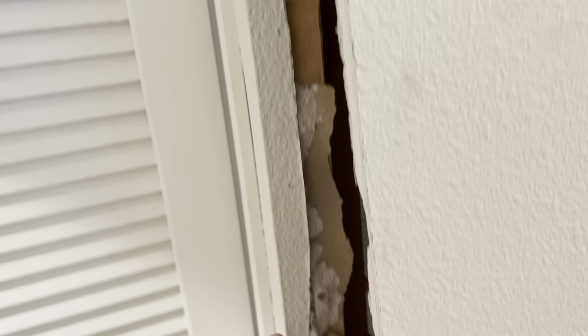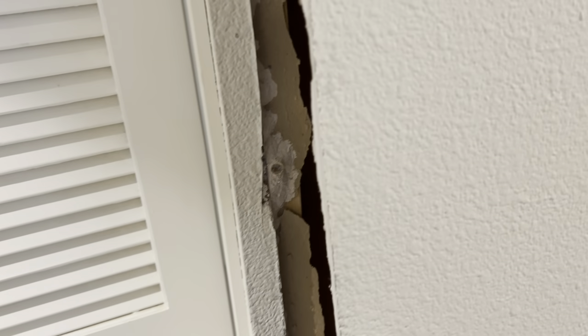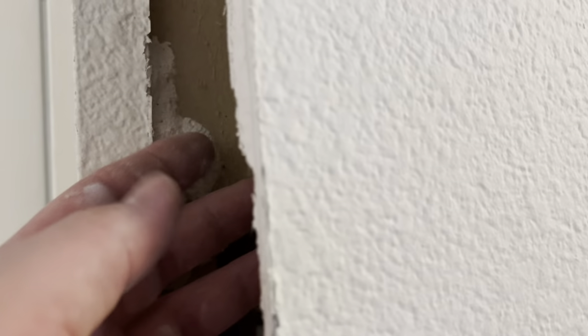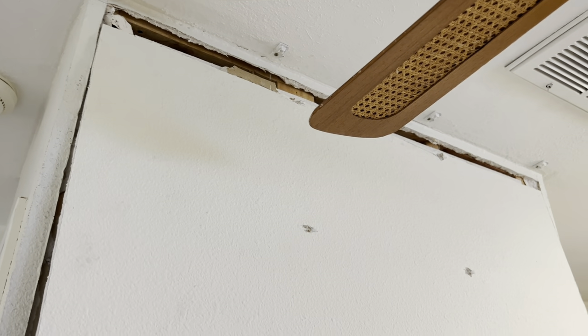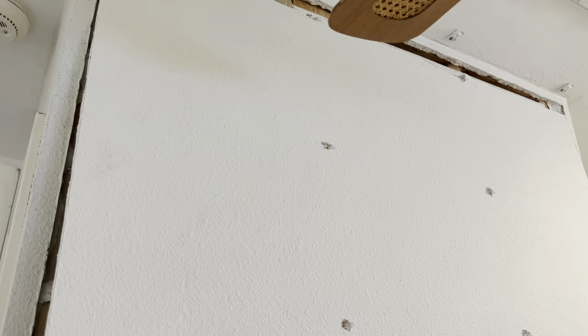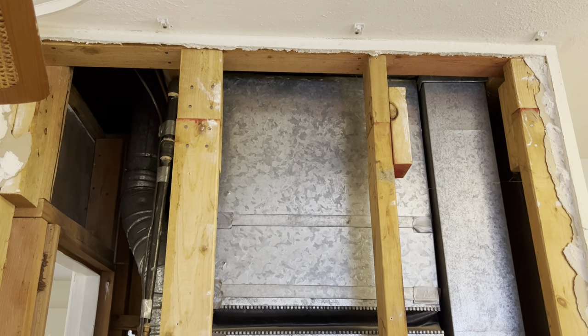As you can see at the bottom we didn't have to cut at all, and this side is very clean as well. So is the bead here, because again I cut it right up against the bead. I just noticed something — there were nails here too that I never noticed. I assumed they nailed it underneath this part, and that is what they did over here. Thankfully those nails staying in there didn't cause too much damage — it made it quite thin here but did not go all the way through and ruin the finish, and that's what I'm most concerned about.